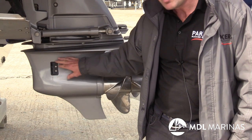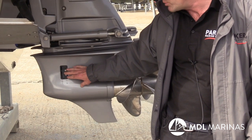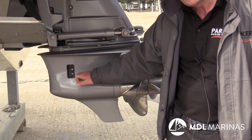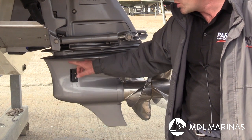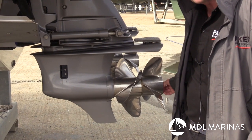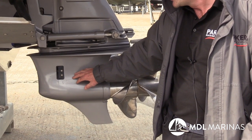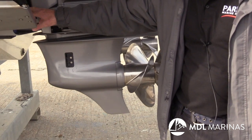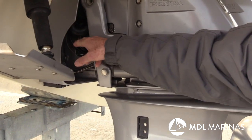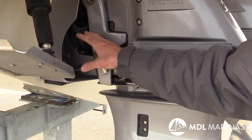This section here is where water gets sucked into the engines, so we can flush the engines from this point. We use what we call a bellows — a contraption that goes over each water intake. We put a hose on it, and once the hose is running we start the engine, then wait for water to come out of the propellers, which is also the exhaust. Once it's been run for about five to ten minutes, the whole system is completely flushed of seawater. Also in here there are lots of rubber components — being left dry over winter, they can start to degrade and harden, so it is good to soak them in a silicone spray to protect them from hardening.